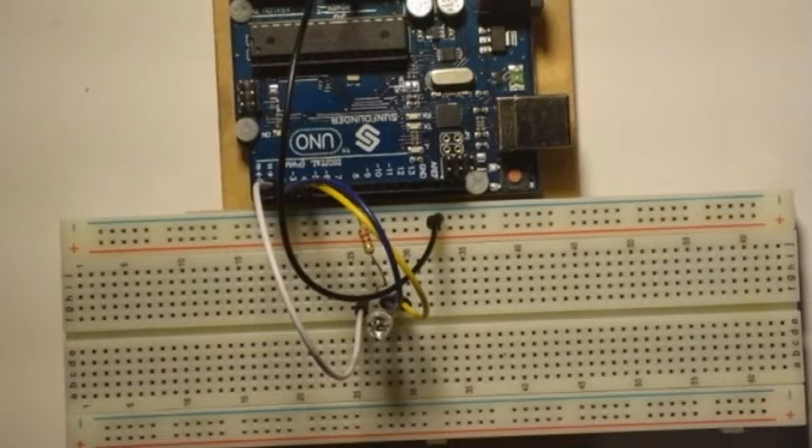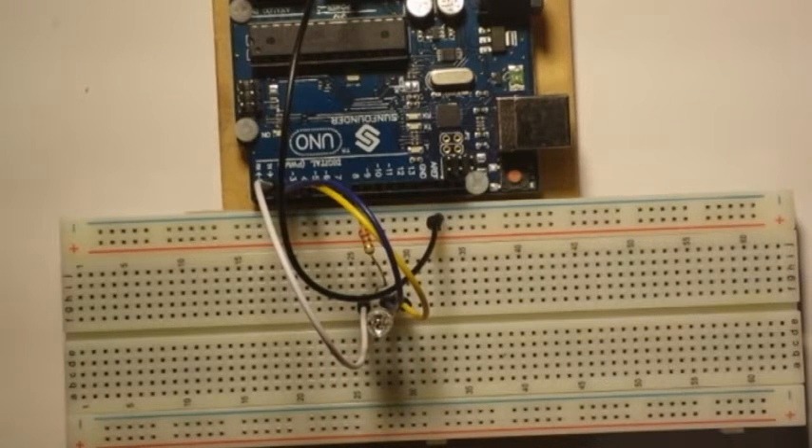So all you have to do is a digital write on any of those pins to light up that RGB. You can light up more than one pin at once for mixed colors — for instance, to get purple or whatever else you can think of. We're going to cover that in a programming lesson here in a minute. What we're going to do today is light up this RGB LED in the three primary colors — red, green, and blue — by reading a color from the serial monitor. Let's take a look at the programming and we'll knock this thing out of the park.